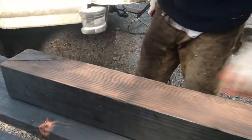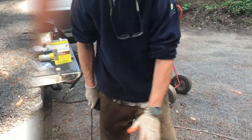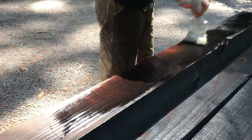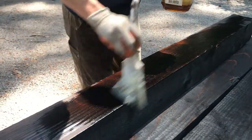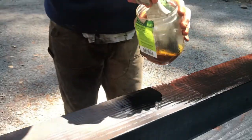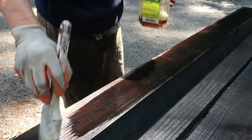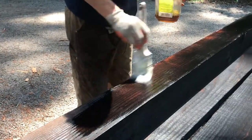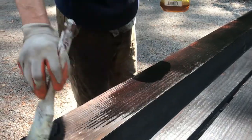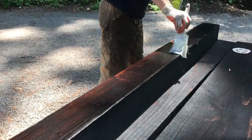I'm leaving a little bit of the charring on there so the grain pops out between the char. This is the linseed oil treatment — it shines up real good, and then the color deepens and enrichens after the linseed oil dries out. This is redwood, which is already a really rot-resistant wood, and with the Shou Sugi Ban treatment and some linseed oil it makes it look really cool, old, and rustic and should last quite a long time.